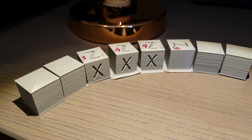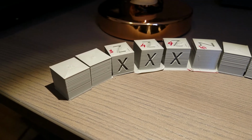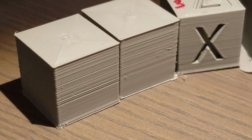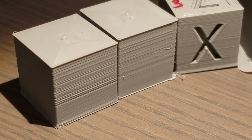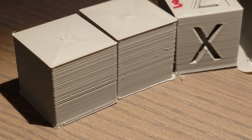After printing a few more cubes, I still notice that right here, this beginning of the cube is very well printed, and then after that it just goes with this chatter, like ring chatter, that happens from like 8 or 7mm to the end of the 20th millimeter when it finishes the cube. So even with all the tweaks I've done, I still cannot print the cubes right.